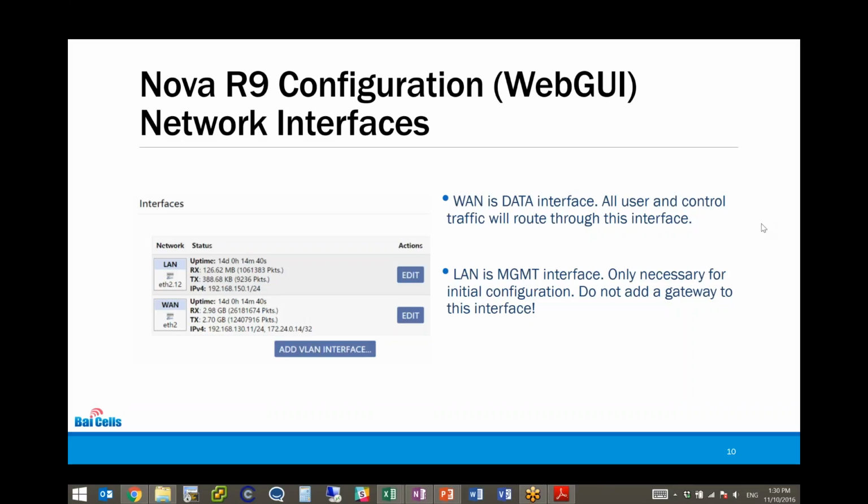I'll hit a couple questions here quick from a little bit down below. Henry asks, any way to apply QoS on the eNodeB? In LTE, we use something called bearers, which currently with LGW, we can only support the default bearer. So there's no special QoS settings that can be applied, at least today. That will also be updated to support multiple bearers, so the answer would be soon, I guess. If you have your own EPC, then you don't need to use LGW, and you can just natively support the standard LTE bearers. So, using our cloud core, the answer would be not right now, and if you have your own core, then yes.